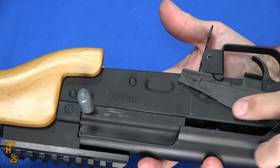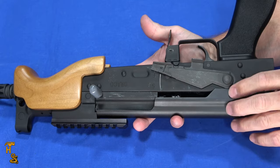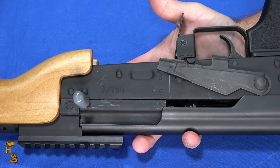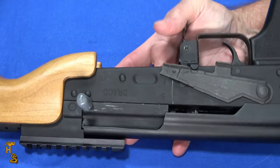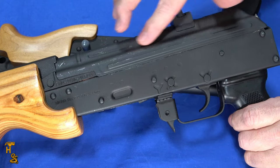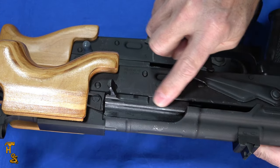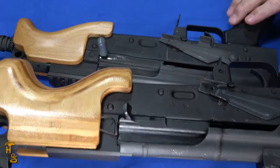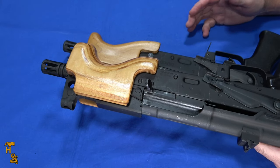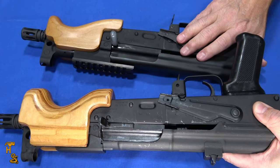The body is all phosphate coated, which should help with corrosion. The dust cover is not — it's just a regular standard finish. The bolt is phosphate coated, and that's going to play a factor in some of the reliability we encountered. The original Romanian one is phosphate coated on the body and dust cover, but the bolt is not phosphate coated — it's just got regular treatment. I think that makes a difference in reliability. The Romanian one worked from round one, which is typical of an AK; these things just work regardless of what you do with them. This new one we had some trouble with, and I'll get to talking about that.